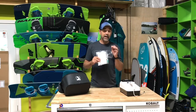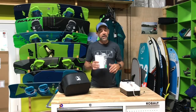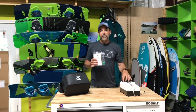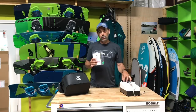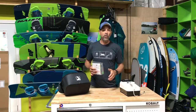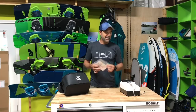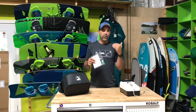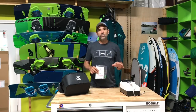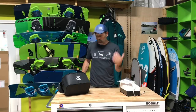The thing to remember about these pumps — basically any electric pump — is that once stored for anywhere between two to three weeks, make sure to remove the fuse. There is a little bit of trickle charge that goes into the computer board, so take it out, tape it onto your pump, and store it away fully charged. The only thing that will gradually go bad is the battery, but they're easily replaceable — about $20 to $25 for a lead-acid battery. Simply switch it out and you're ready to rock.